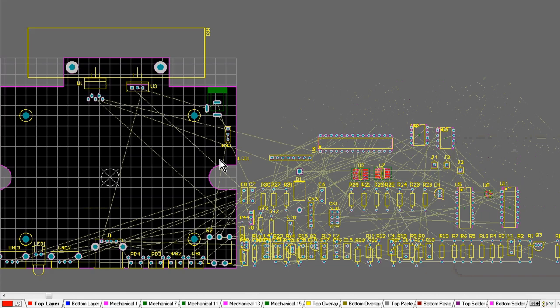But when I'm designing and laying out a board like this, you're forced to use both imperial and metric dimensions, because I will use metric for things like hole sizes. I'll use 0.8 millimeter hole instead of X amount of thou. So I will also use metric for the dimensions of the board, and possibly placing components and the center of components and things like that.